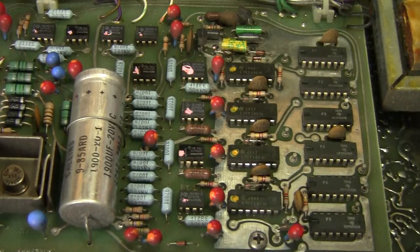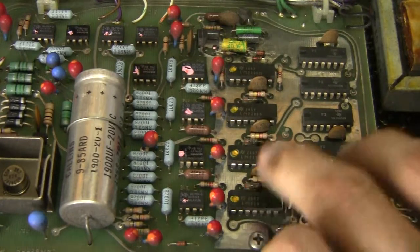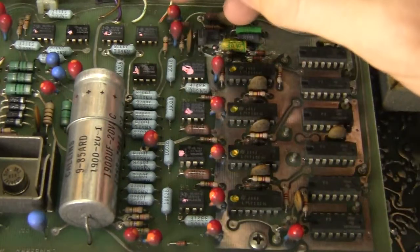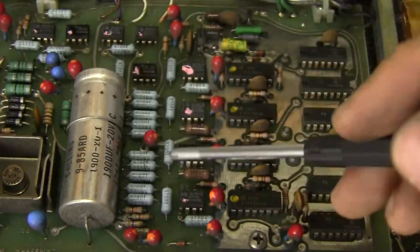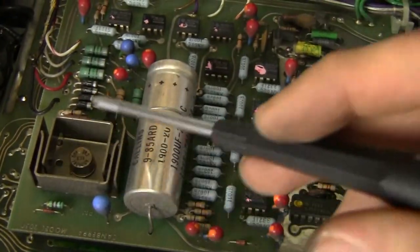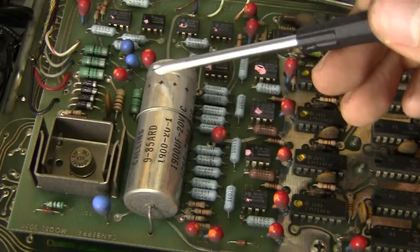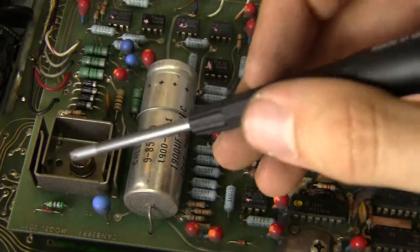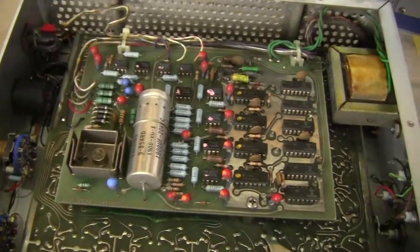Some sort of op-amp type package or comparator — quad comparator, I think those are actually quad comparators. And then it's like some sort of analog thing. We've got some sort of power supply around this area. You can see the bridge rectifier with the four diodes right there, and then a giant reservoir capacitor, and then a bypass transistor for power regulation. Looks like we need to go to the other side of the board to see the other circuits in this unit. Wow, looks pretty nice — it's pretty symmetrical too.